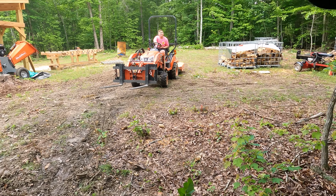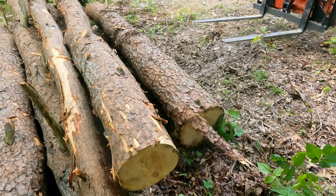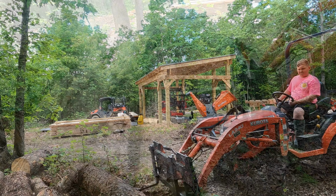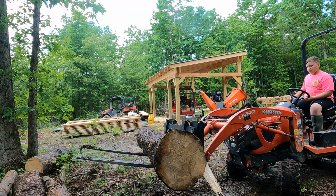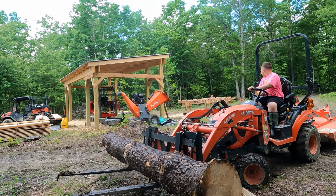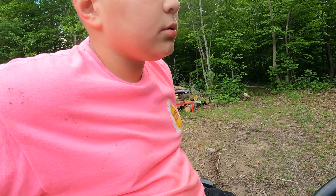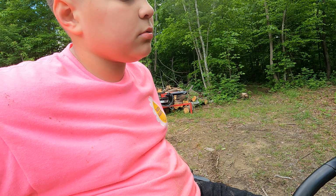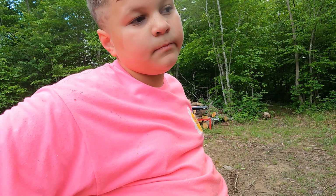All right, come on. Which one? Front one. Front one? Yeah. No, tilt her back. There you go. Okay, you got it. Now, straighten your wheel out. Don't turn around right there. Now stop for a minute. Okay, so when you've got a heavy load in your bucket like this, the tractor could tip over very easily. So you always want to run with it way low to the ground, almost dragging the ground. That keeps it close to the ground so you won't tip over sideways. And then you always go slower when you've got the weight in there because the tractor can teeter-totter around on you, okay?